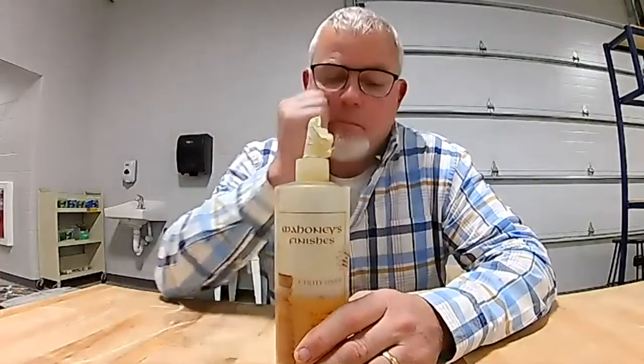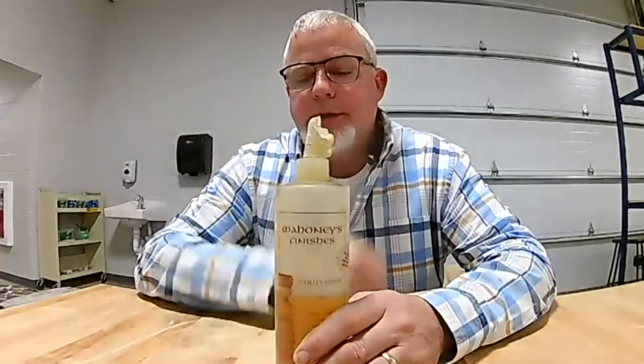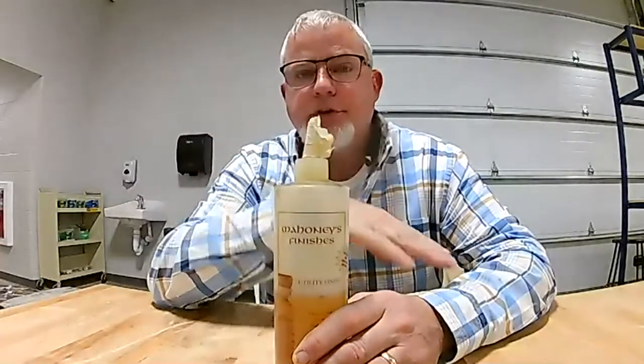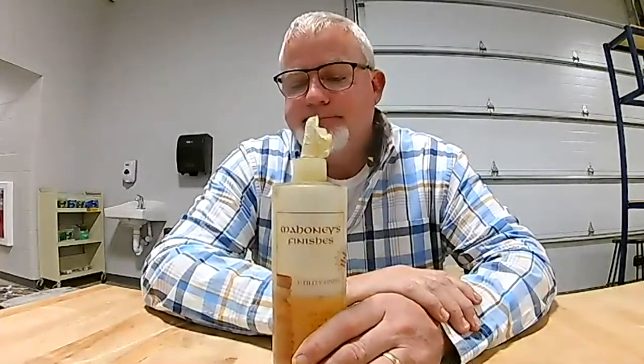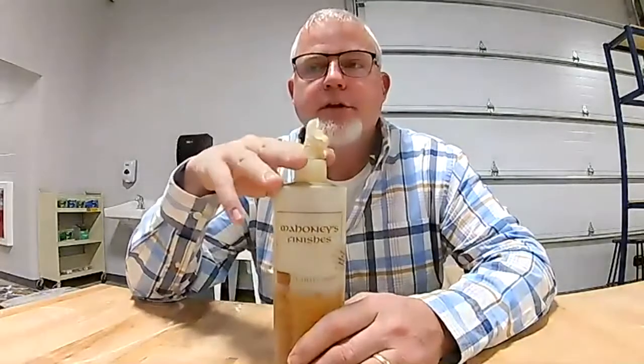Anytime that you're trying to do a food safe finish, a cutting board, a bowl, whatever, oil finishes are your most popular. In theory, any finish that has cured is food safe. So even if it's something that you spray on, a urethane or something like that, something that has to set up and cure, I've heard that anything that is cured is food safe. I like to use what I know to be a food safe finish, which is just a naturally occurring oil. What you want to stay away from is oils that could possibly go rancid. Like I would never use canola oil or vegetable oil or anything like that.